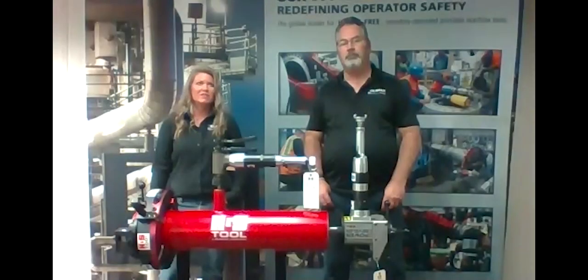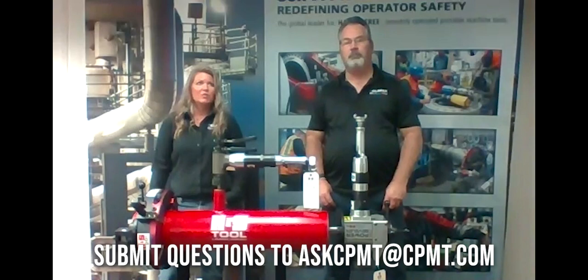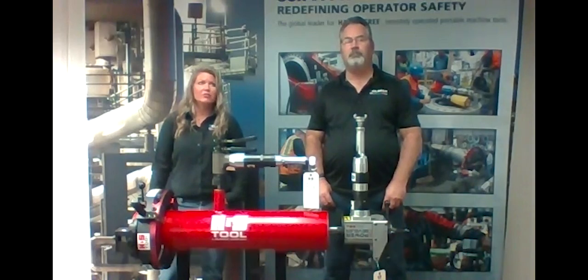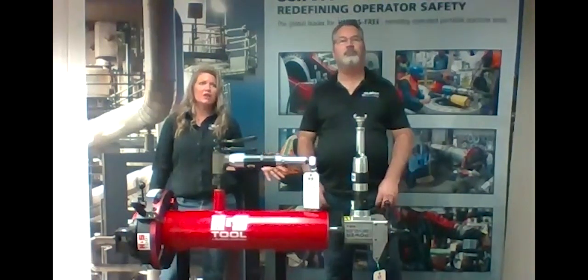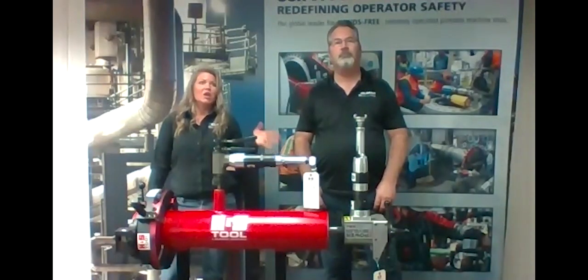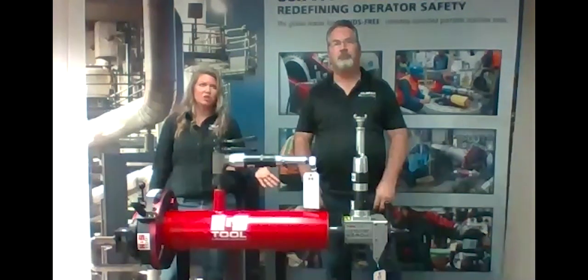I'm Erica Jackson, the H&S General Manager, and with me is John Gajowski, our lead technician for the boiler gun and power beveler line. Today's demo is over the PB6 power beveler. The range of this machine is 1.7 inch ID to 7 inch OD, with a primary function of putting an OD bevel on a tube or pipe. We are featuring a 37 degree bevel in the demo, but you actually have several different bevels that you can do with this machine depending on your tooling.